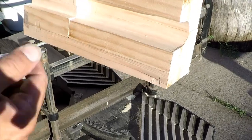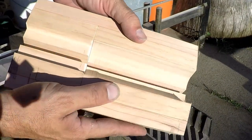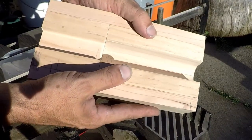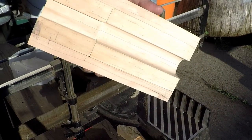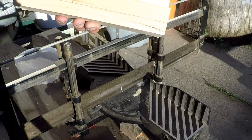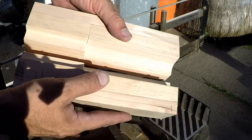It'll come out straight through here, but this thing isn't going to work that well, so we have to split it in two pieces. Sometimes these core boxes get so complicated it's like a puzzle putting them together and taking them apart, but you can make very complicated shapes with these. Let's go find some dowels — we're almost done here, coming into the home stretch.